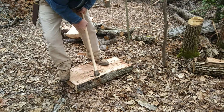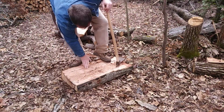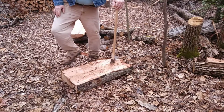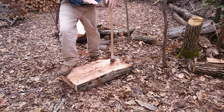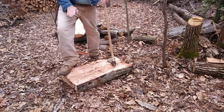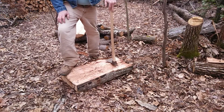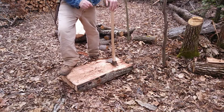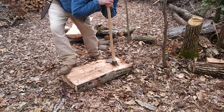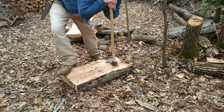And wood that is adzed to the point to where it's smooth and ready for the plane is adzed. Wood that still has sways and lumps in it that go across to where the adze hasn't leveled it off for the plane, where it's got a lot of work for the plane to do, where you jump and skip as you go across with your hand plane, that's called half adze. A few terms have been coined from that.